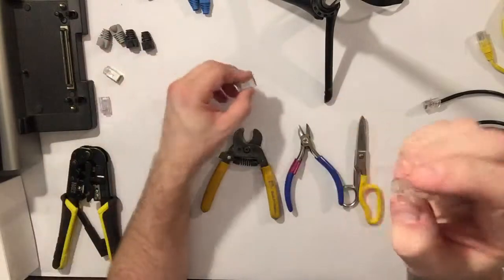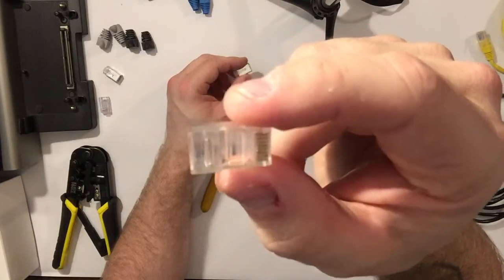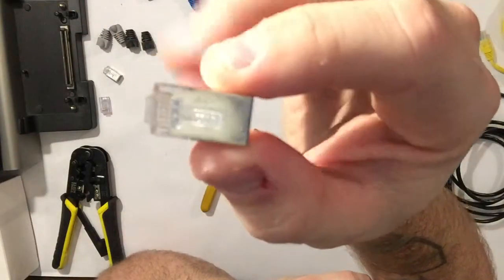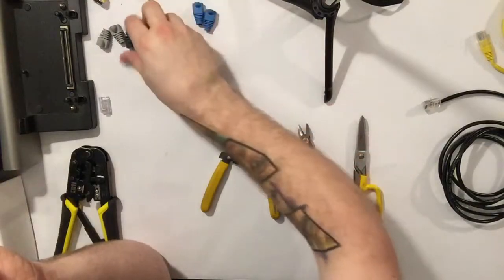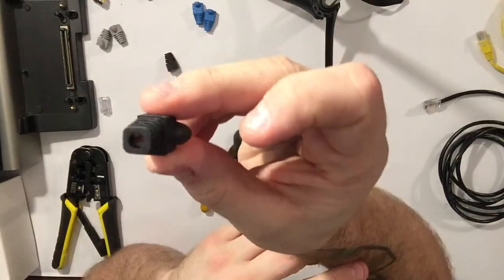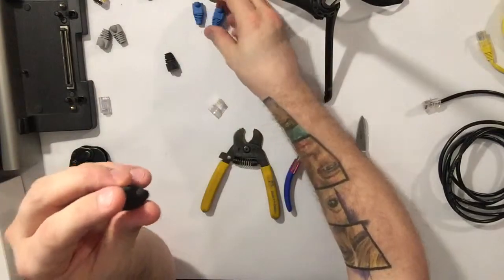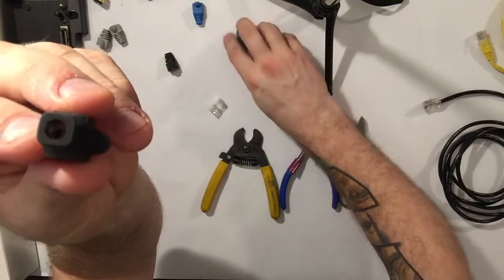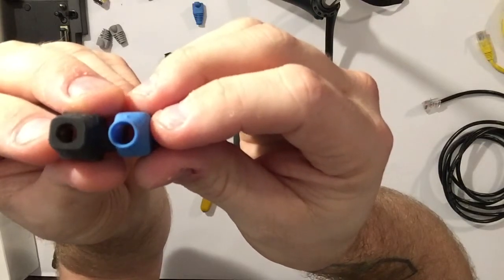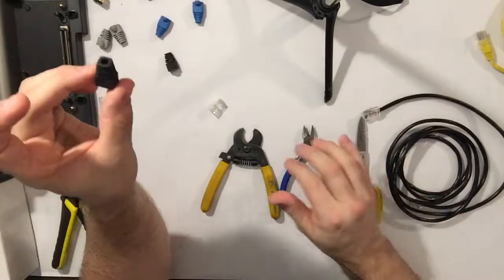Looking at the connector types, these are RJ45 — they're 8-pin. When they're clear like this, it shows that it's for an unshielded cable. When they have the metallic piece, that's a shielded cable — that's another tutorial. I like to use the booties here so it looks more like a professionally done store-bought cable. You can get them in assorted colors, and you get them for whether it's a Cat5 or Cat6. A Cat5 has a smaller opening, where a Cat6 is a larger diameter to allow for the larger insulation and cable. Since our cable is black, I'll use the black booties today.